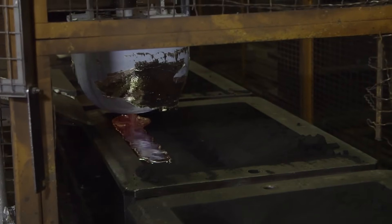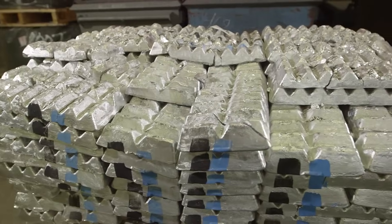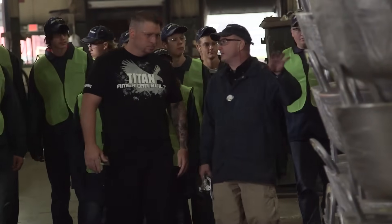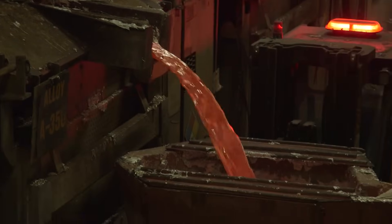I knew that's what happened because when the substrate is installed the right way, it has five little prongs on it that lay in a series of slots in the mold insert. In this case, when you flip the substrate over so that it was backwards, you could see an imprint of those prongs where they smashed into the mold on the wrong side, because there were no slots to accept it like there should be.